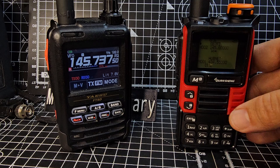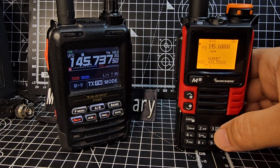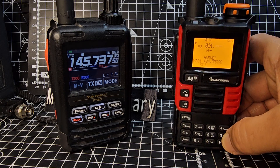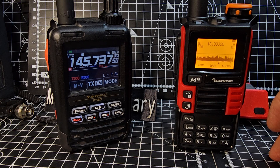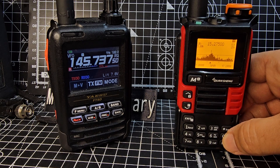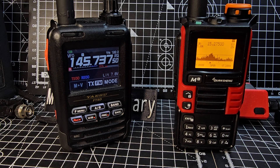Once the firmware modifications were enabled — look what it does: 27 megs, you just saw it there. The board I think will go right down to 15 megs — let's quickly try. Exit, go into VFO with F3, and start typing — let's do 14 MHz. Oh, it does actually show it. Whether it receives on it is another matter, but it does allow me to do it. F5 — that's showing 14 to 17 MHz and we can change the mode. USB, very low power — M0FXB test test test.